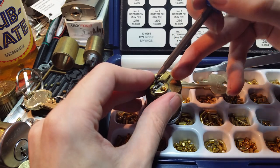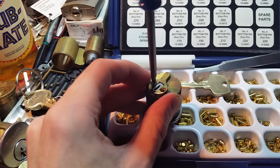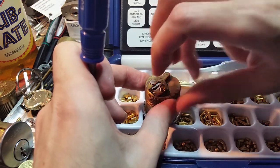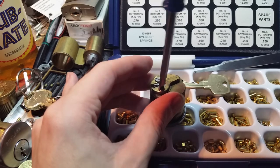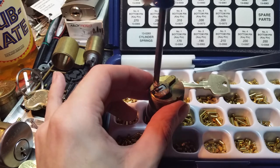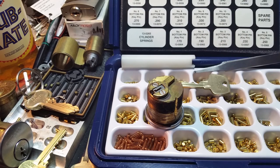This is an older model so it still uses flat head screws, so reattaching them is a little bit of an exercise. Don't tighten it all the way with the first screw — wait until you have the second screw in as well, because that will help make sure the cam stays correctly aligned. If you're using a Schlage-style cylinder with a screw-on cap, you don't have to worry about that. If you're using a spring clip, C-clip, or E-clip-style retainer — which is common on a lot of models — that's obviously just a single piece, so you don't have to worry about tensioning it correctly. It's only when you're dealing with two or more screws that it really matters.